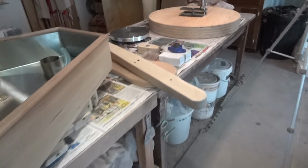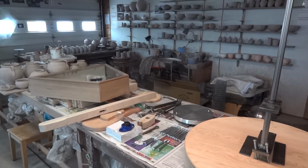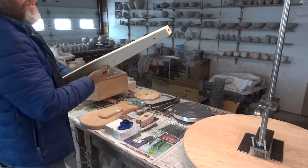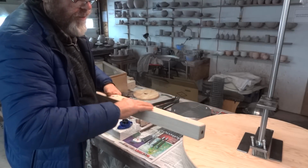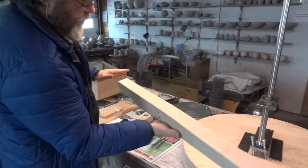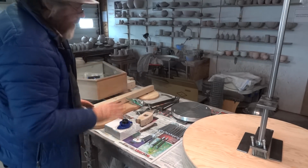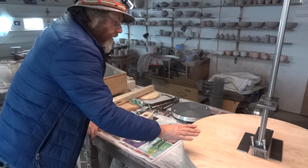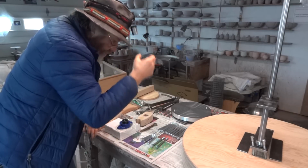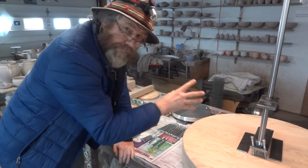So yeah, in the kit, just put this back up here. In the kit itself, there are instructions about how to finish this. Bearing in mind that this is a kit, some sanding is recommended. Although I have to say it's pretty smooth. You couldn't say this was badly finished. This is beautifully machined, and it's smooth as anything. But it wouldn't hurt to just go over everything with some fine grit sandpaper. Okay, and then what is recommended is several coats of varnish, polyurethane varnish, thinned down so it penetrates deeply into the wood. All right.